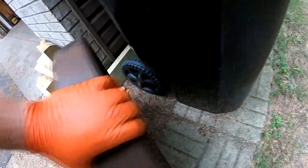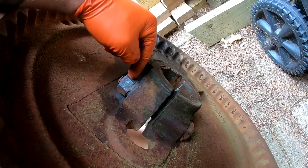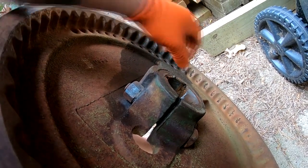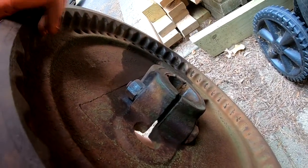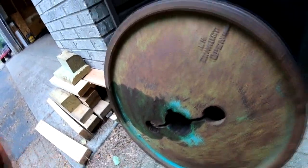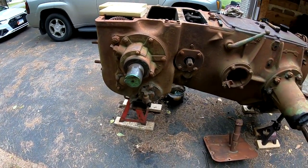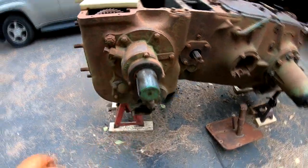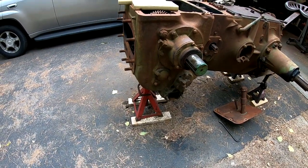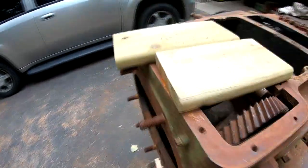From there, what we have to do is loosen the bolts on the back of the flywheel. This one I was able to get loose but it stopped up on me, so I'm guessing the threads on this are probably junk. But you loosen the bolts, drive a couple wedges in here, and then slowly walk the flywheel off - that's all there is to it. It is heavy; I would guess probably 150 pounds at least, maybe 200 pounds, so have help, use an engine hoist, or wait for help.